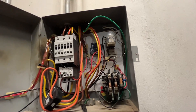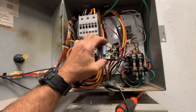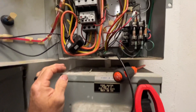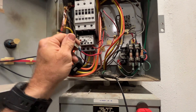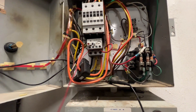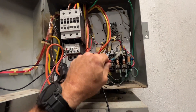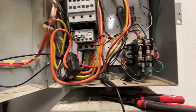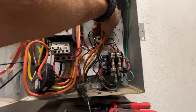I'm thinking of moving all this down and putting that motor saver right up there. We're going to make that time delay go away - it basically crumbled in my hands trying to take it off and move it, so honestly I don't think it was doing anything. It was just going to be an overload normally-closed circuit, so we'll just run off the common from the low-voltage transformer control circuit. There's one less thing to deal with in here. I'm going to drop this cube relay down somewhere.